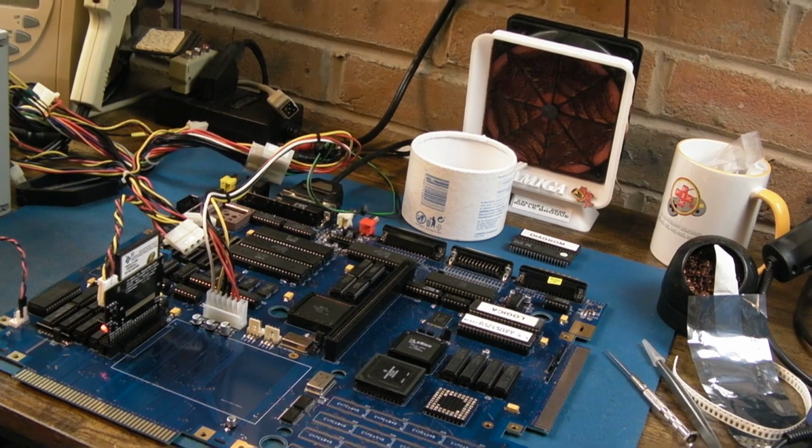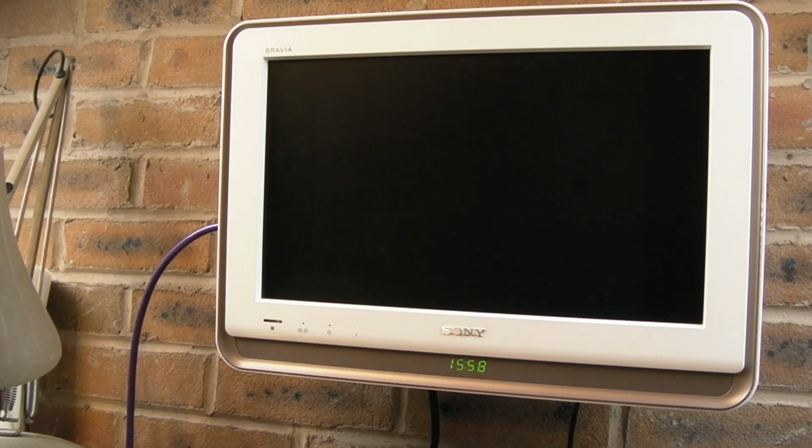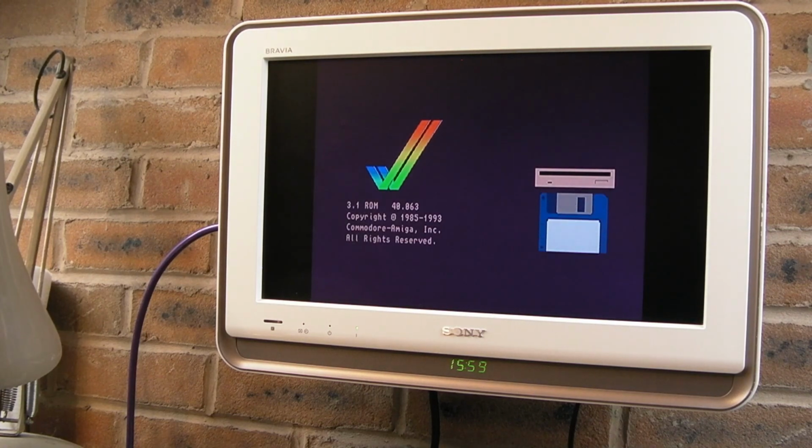It's just rebooted, by the way. Yeah, it sat there and it just reset on its own. This is the thing, so why is it doing that? I'll remove the card there and I'll just disable the boot ROM. Why is it rebooting itself? This is a concern. I mean, it could be anything. It could be one of those GALs that's glitching when it's being warmed up. It could be the Lattice chip that's glitching when it warms up. I mean, sat there, it's not rebooting now. That was after just a quick power cycle.